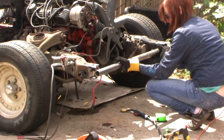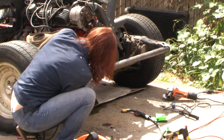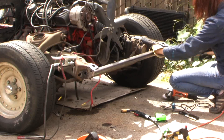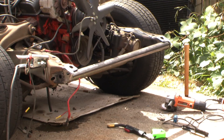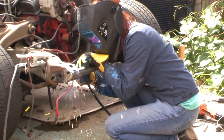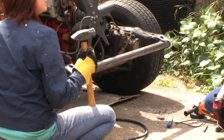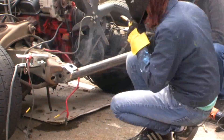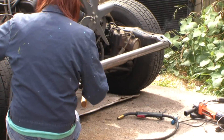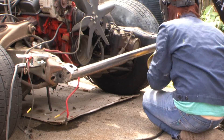It fits in there nicely. Now I'm pounding down these tabs so that this bar will be really stitched in nicely to the chassis. The metal's going to deflect back a little bit, so I'm bringing the welder in and tacking down different areas — doing the back side of the weld, that semi-circle I was talking about. Now that it's a little more rigid, I'm driving these metal pieces in closer, repeating this over and over: weld a section, drive the pieces of metal in closer so I can get a really good weld. I've seen tons of pure stock cars where people just slap the bar in across here and don't stitch it in, and they get into a minor collision and it just rips the frame out and their bumper is dragging the ground.